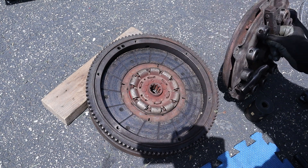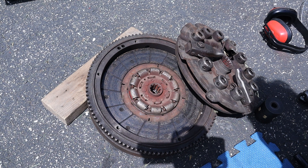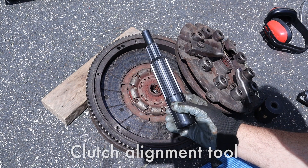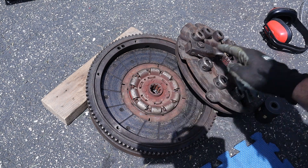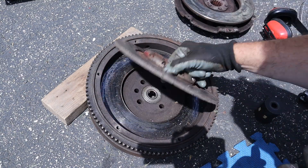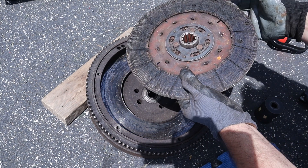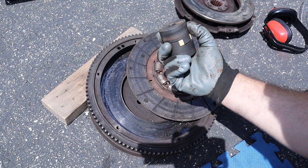I don't want all of this — this is about 80 pounds worth of equipment here. But to be able to connect the electric motor to the input shaft on the tractor, what I need is the splined piece from the clutch and from the clutch cover. Both of those are really just held in by rivets, so if I grind off those rivets, I can save that center piece, throw everything else away, and then make an adapter that will connect the electric motor using maybe something like a Lovejoy coupler.